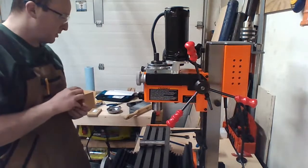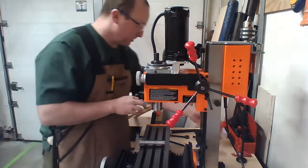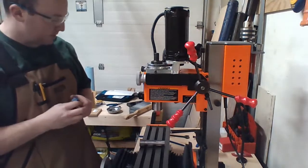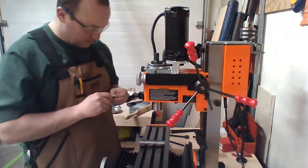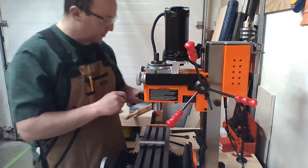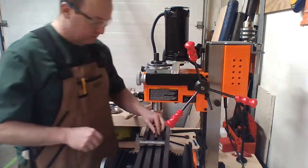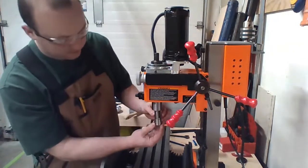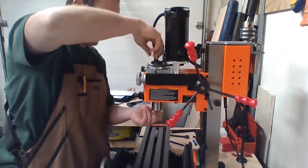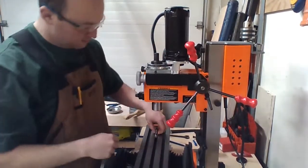This thing came with two end mills, weren't all that fantastic. And then I got, oh, there. I want to try this guy. Quarter. Do I want to do the 2-flute quarter? I want to keep this speed up high, so I'm going to use the 2-flute half-inch. Put that guy right there. Find my hole there, put a couple threads in. Plug it, tighten right there.